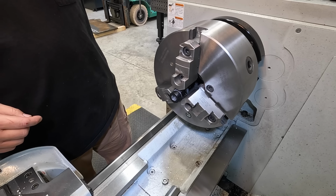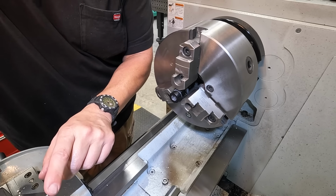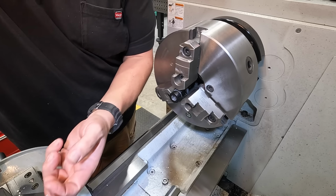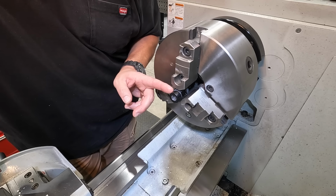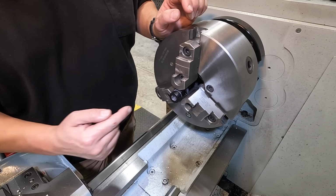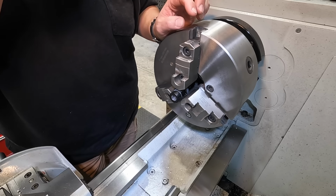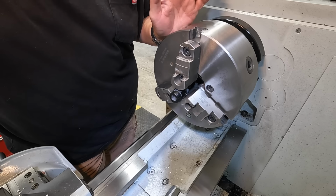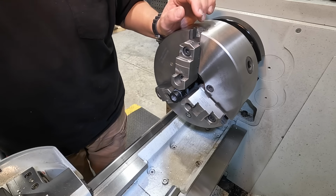It should be right, because I measured the tool before I stuck it in there. The carbide tool is 0.126 wide, and the width that we wanted is 138 thousandths wide. So that's a difference of 12 thousandths. So once we made our first cut, I moved the tool in Z direction 12 thousandths and brought it back out to 750, which should make the 138 thousandths wide groove there.